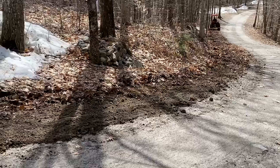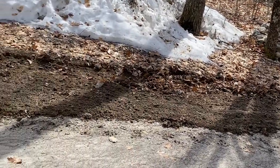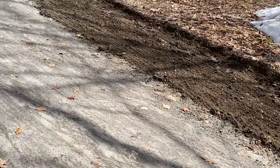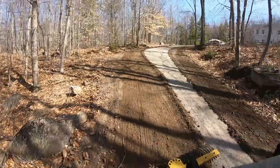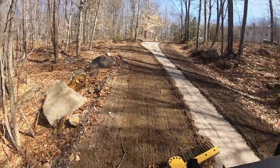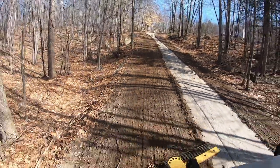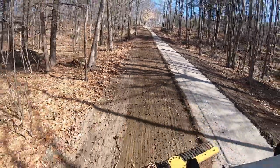One way of looking at it, if you think about what the stereotypical dirt road looks like, you're basically talking like a two-track. You have two lanes where the tires go and then a high spot in the middle. That really is an opportunity for erosion, because the water is going to try to run down those two tire tracks. It's going to take the path of least resistance out of the road, and it's going to end up taking most of your driveway with it.